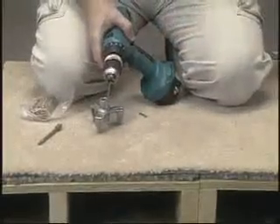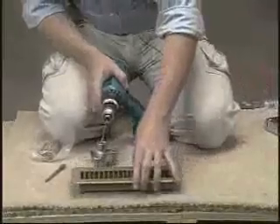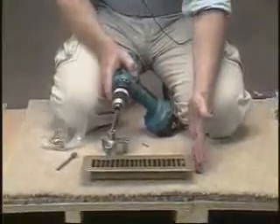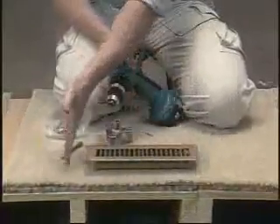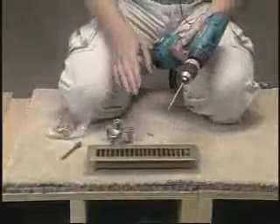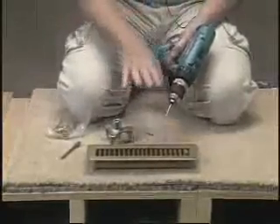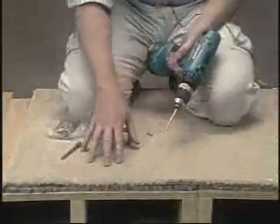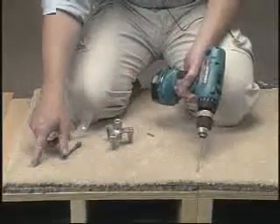There are some ways to get real close to the joist just by walking into the room. If your room has a heat vent, you know that the joist is on one side and the other of the vent. We can use that to start, find the exact location of the joist, and once we find one joist, we can just measure because the joists are separated by 16 inches.